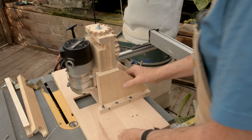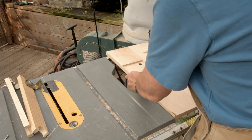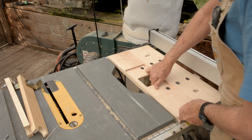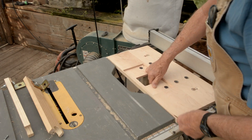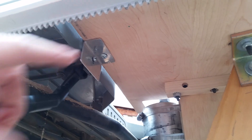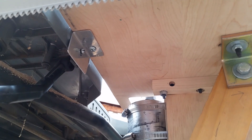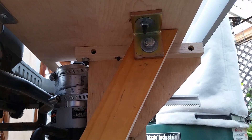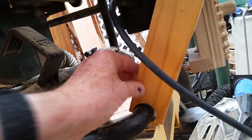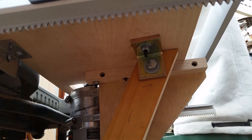The idea is this will fit in here. I've got a couple of brackets that will hold it in place. This is what the underside looks like — you can see a bracket right there. I've drilled and tapped into the frame of the saw, and there's the same thing on the other side. Here I've got a support rail that comes down and is just sitting on the frame of the saw — it's got a little bit of wiggle room. That's just to hold the cantilevered weight of the table. And then I left a slot in here so I can adjust this back and forth and level it.